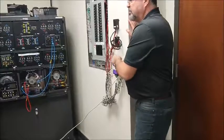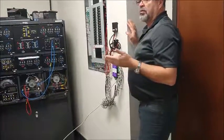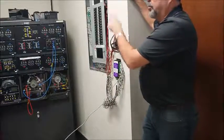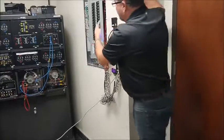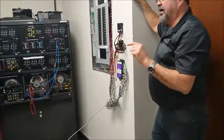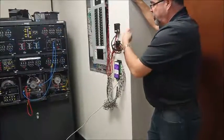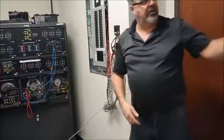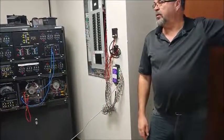And you also have to do a bit of a map. When you go to a restaurant and you open up their electrical panel and you put all these things on, you're hooking it up to breaker number 1 or number 3 or number whatever. And those breaker numbers are right here. You have to document exactly everything that you can. Now, when the second years and I were doing this earlier this year, they made a table that's up here. And I'm going to be referring to that in a few minutes, all right?